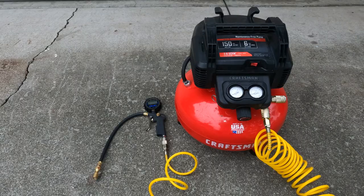The drawback of the Astral AI is that it works best with a tank-style air compressor. Here's a picture of the tank-style compressor that I bought after using electric pump-style inflators for years. It cost about $125 and is rugged enough to last. Electric compressors are noisy, but tank-style compressors are only loud while recharging the tank. I usually leave mine turned off until I need it — although it's also fun to leave the compressor on so I can hear my startled wife shriek when she walks by it in the garage and it kicks on unexpectedly. You don't need to wait until the tank reaches full pressure to use it. Full pressure — 150 psi — takes about two minutes, but I find the tank has sufficient pressure after about 30 seconds.